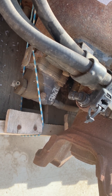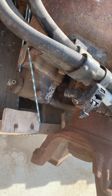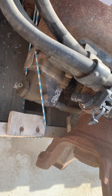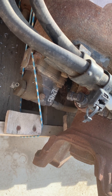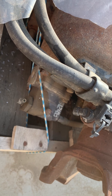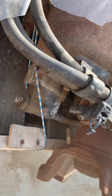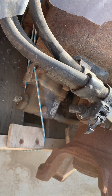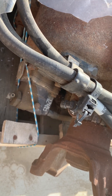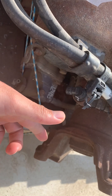Depending on how much the engine is derated — if you have a 500 horsepower engine and they do a 15 or 20 percent derate, you still have quite enough horsepower to get over the hills and go home. When you unplug it, two things happen: your odometer stops working and your cruise control won't work. Your jake brake does still work. Make sure if you're doing this you're an experienced driver — you don't want to be doing this if your license is only a month or two old. You need to be a seasoned driver before messing around with your unit.